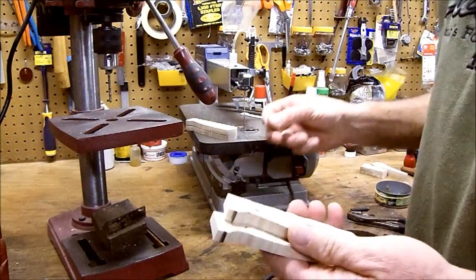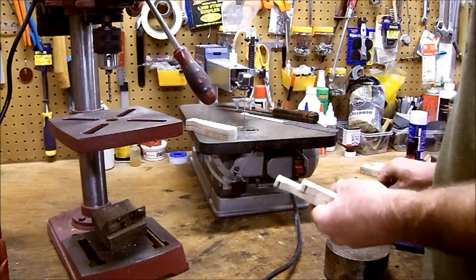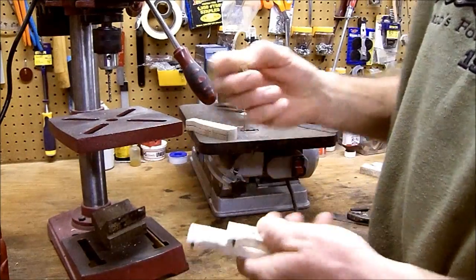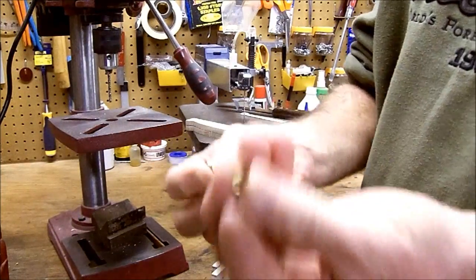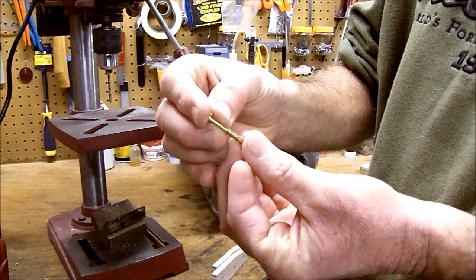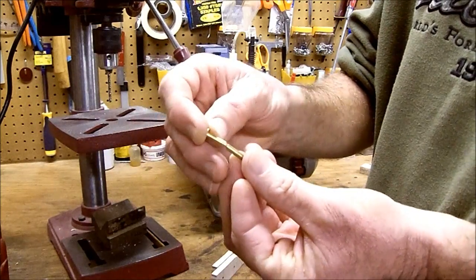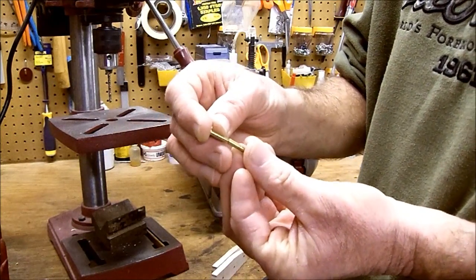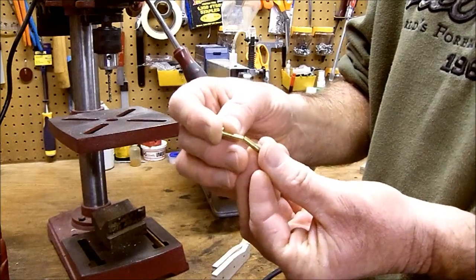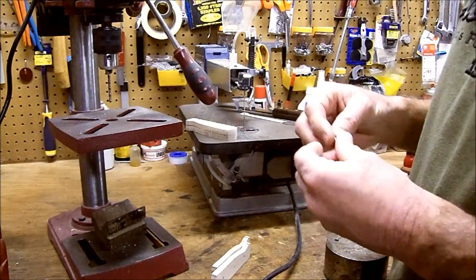We're going to put them together with rivets. Cutlery rivets, they're called. Male, female. Basic as can be. It's compression fit. There's about 20-25 thousandths difference in diameter from the inside and the outside. It's compression. When they're put together, they are permanent and they are strong. They're about 30 cents a piece, so you got $1 in your knife.